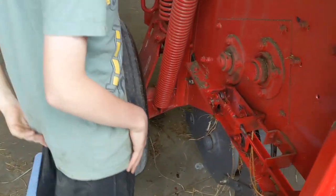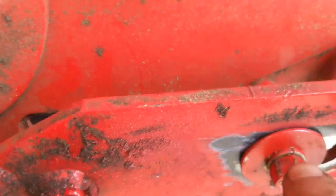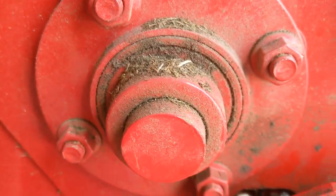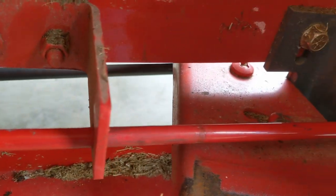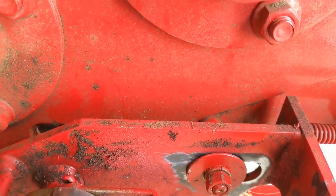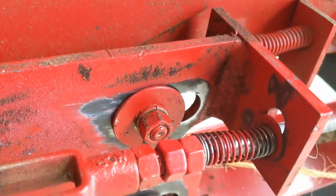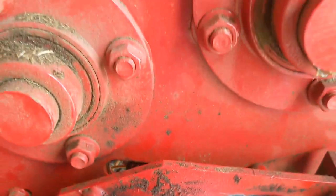That was making this stick out — the mechanism. We had to take all these bolts out and polish all the paint off. It's quite thick — primer and paint probably baked on. This was all binding up and it would get stuck in the down position so the arm couldn't swing over. All these little things add up. The spring here made the paint like it was threaded, so the washer that slides would catch into threaded paint. You had to get that off. Just little things you've got to do to get these working properly.